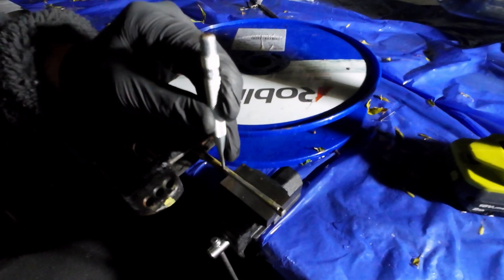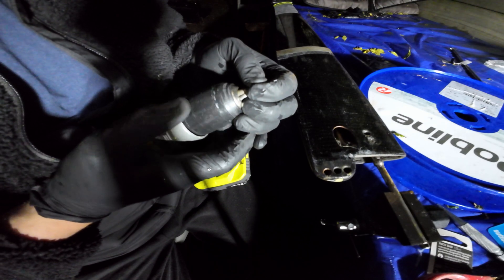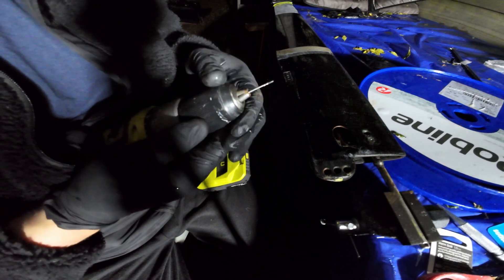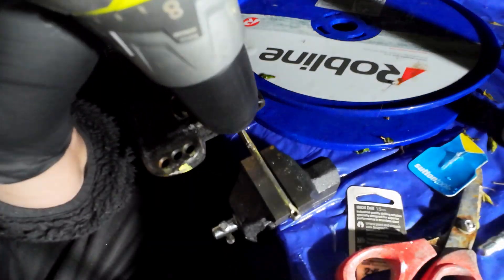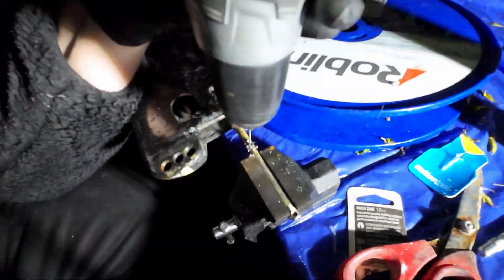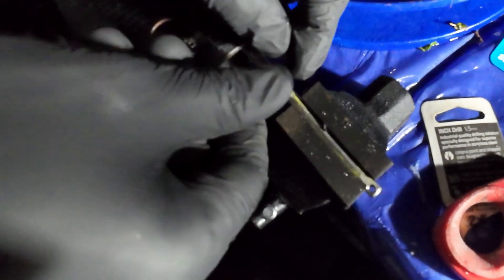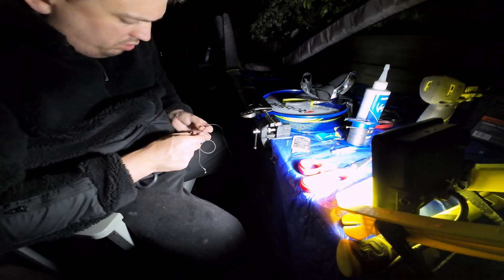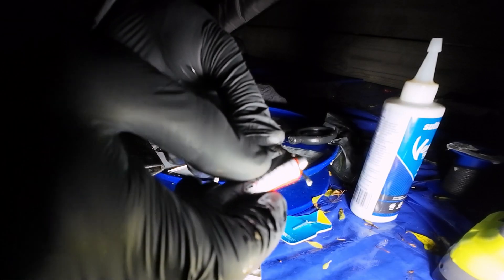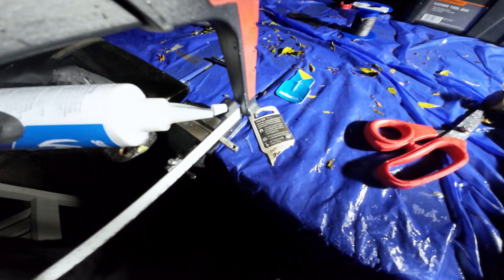I've always been a bit daunted by cutting and drilling because it never goes well. Turned out I just needed cutting oil — it's like trying to do carbon fibre without epoxy, it's just the biggest game changer. It also smells like the smell of Australian manufacturing. Thanks to the cutting oil, I got the hole for the R-clip drilled in, then promptly dropped it in the gravel. Eventually I found it, spliced a little Dyneema strop onto it, soaked the splice in superglue so it's holding the pin to the Dyneema, and then that went straight into the boat — now it's all captive.